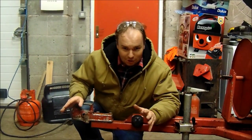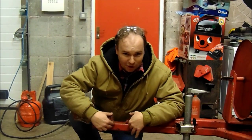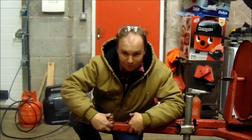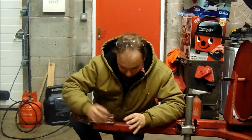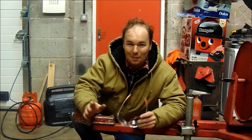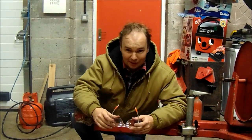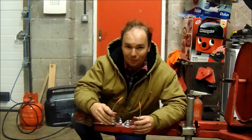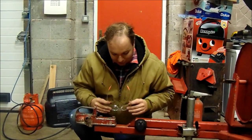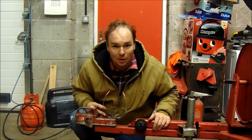The other thing I'd suggest — this is something I've learned through experience — clean a big area off, don't be stingy. It's always better to clean it off with a grinder than to try and clean it off when the heat's transferred, burnt it and bubbled it. It's a pain. Just clean it back. Always wear goggles. And you should always wear ear defenders as well — I've forgotten mine so I'll only be doing it for a few seconds. But if I had forgotten my glasses, I wouldn't do it. I have seen one of these discs explode — it's not pretty. Just get a pair of goggles and wear them. So let's get started — I'm just going to clean this area off right here, then we'll get the welder out.